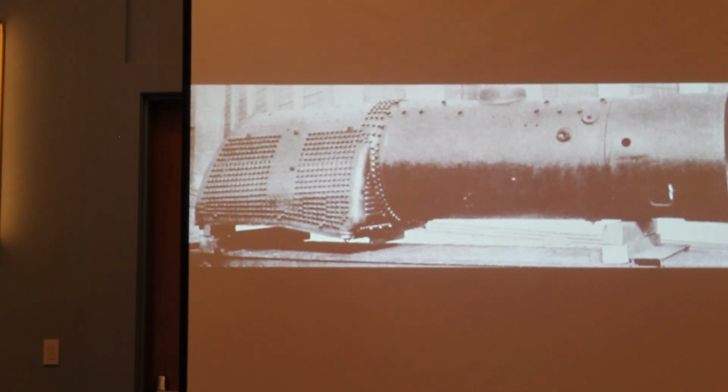Basically, Alco, American Locomotive Company, had this big furnace, and they put the entire boiler assembly in there before any of the other attachments were put on it. Then the whole boiler was stress relieved. You don't want it stressed up even before you put steam pressure on it. You don't want to put it in an already stressed structure.